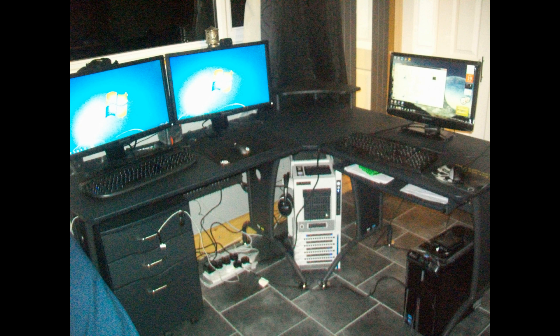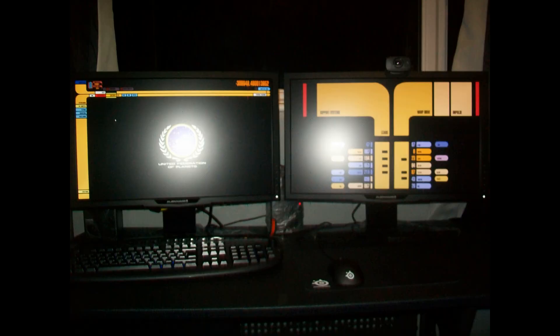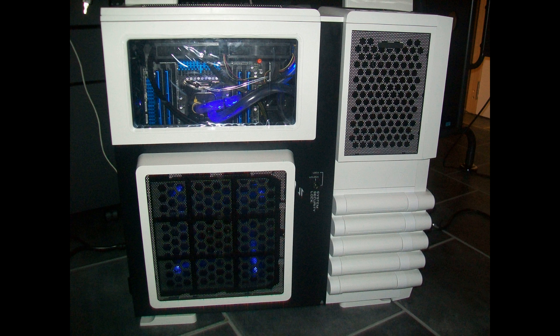Another problem was on my case — the little reset button switch, the small piece of plastic you press in, was actually a bit too long. So it permanently pressed the reset switch. When I had the reset plugged in, which I don't anymore, it would keep restarting over and over, appearing as if it was in a boot loop. That set us back a few weeks.